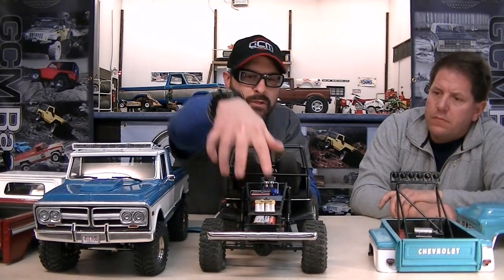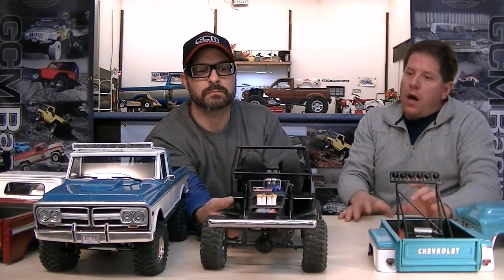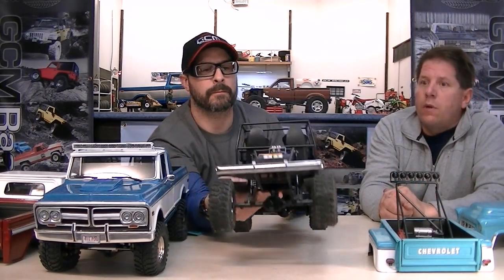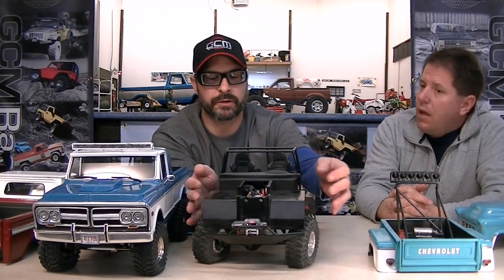Guys and gals — this chassis is just unreal. You can see the rails here. What aluminum is this? It's 5052 aluminum. I cut it with my table saw, make a pattern, sand it, and screw it together. I'll use aluminum epoxy to glue it all together first, and once the glue sets I pre-drill all my holes and screw them all together for added support — because the aluminum glue alone won't stand up. That's why I screw everything.